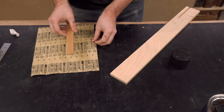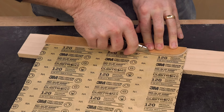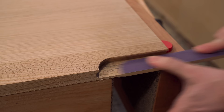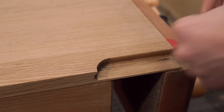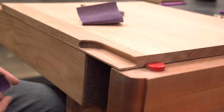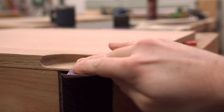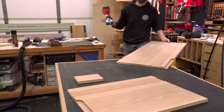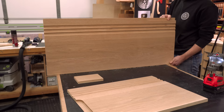The results had a few burnt edges but they were way better than the first go, so I took that as a win and can do the rest with hand sanding. When I have a shape like this that I need to sand, I usually like to make a template so I can sand the flat area and get as far into that cove as possible. My little sanding jig worked great for the flat areas, but for the finger pulls it didn't work - I had to roll up a piece of sandpaper and just work my way around. The long grain was easy but the end grain definitely took a while.